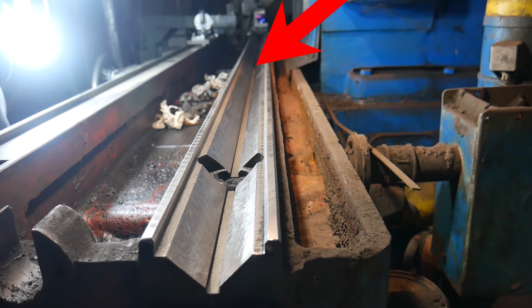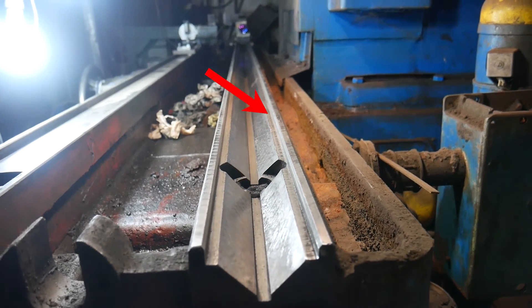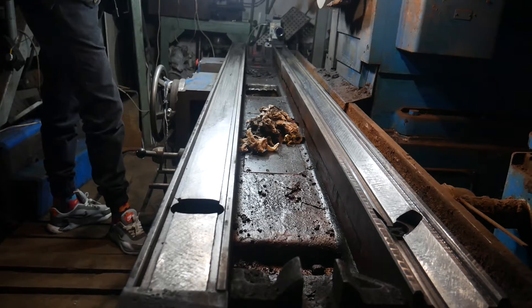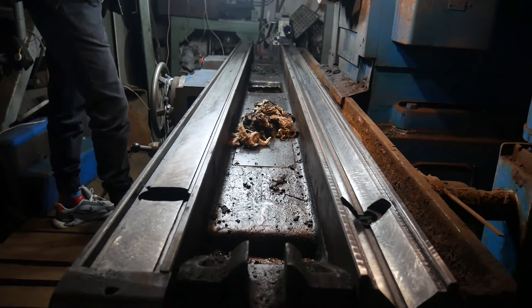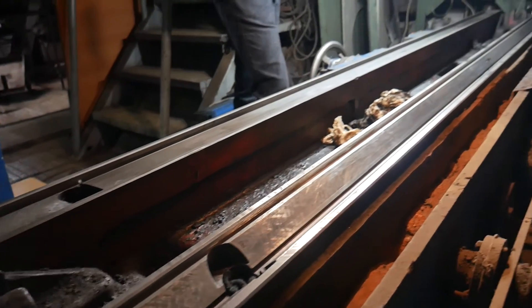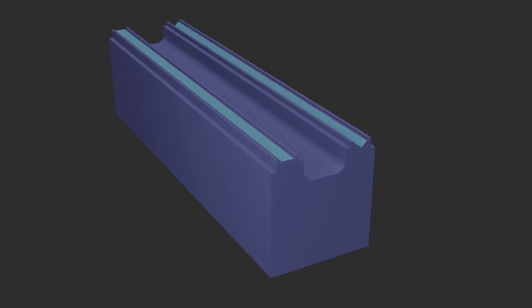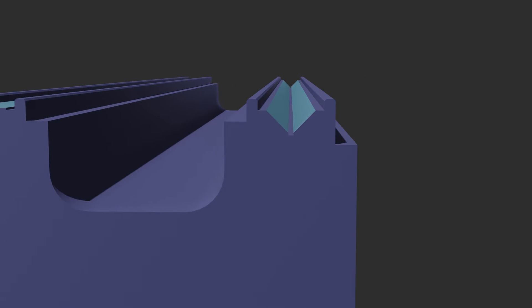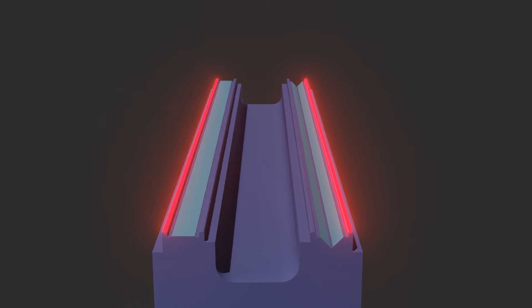The task is to repair this guide along with its flat counterpart. Structurally, there are machines with straight grooves along this pair of guides, parallel to this pair. Their geometry has not changed during the machine's operation as they do not interact with any parts. It can be assumed that they were processed with high quality equipment and their straightness is higher than that of the worn guides. I made an animation so you can understand exactly what I mean. If their straightness is significantly higher than the straightness of the worn linear motion guides, it may be possible to use them to process the worn guides by using a special grinding device, reducing the amount of manual scraping work.